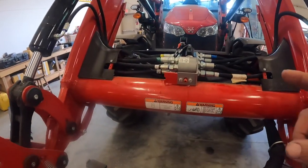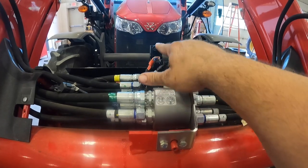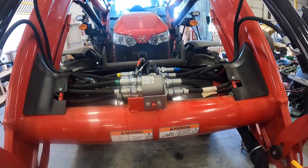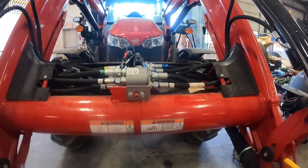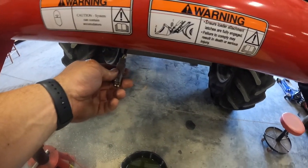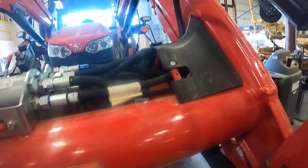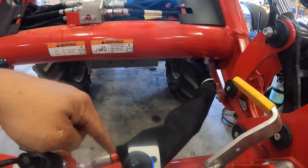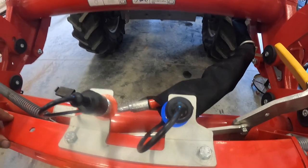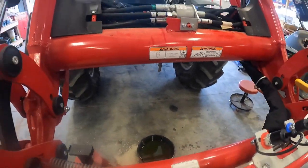So that valve just diverts the oil. That switch on the stick up there actuates this solenoid via these wires right here. And that's how it works. Now, I've got one more thing I gotta do. I've got a plug right here that I'd already rigged up, and I'm gonna plug into it and run the wires out here with these hoses, and that's where my tie grabber will hook up for the fourth function.